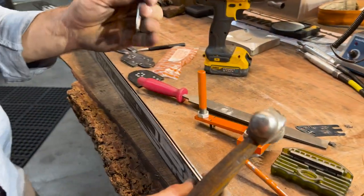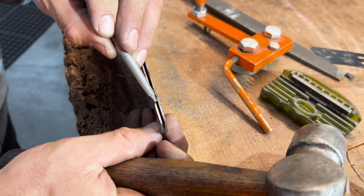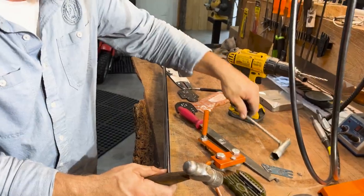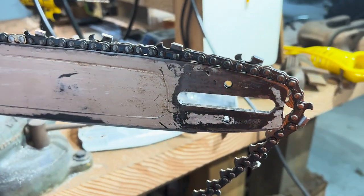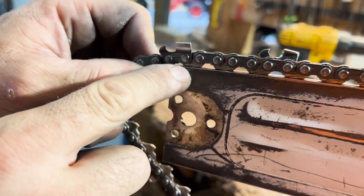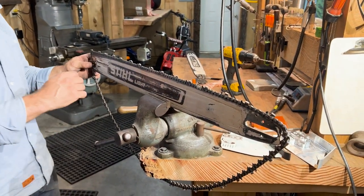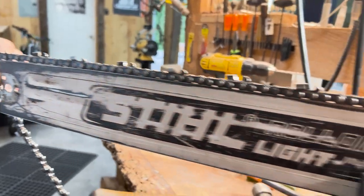Move along the area that was pinched — pick the middle of the tight spot, give it a tap, then go left and right. We're pretty tight here and the chain is sitting up a little from oil and dirt. The section in the middle is sitting in there good now — up front is still a bit tight, so bang on it a little more. Honestly, you could probably put this on your saw and hit go — it'll clearance itself with lube and open itself up.